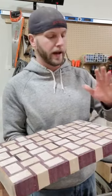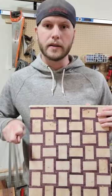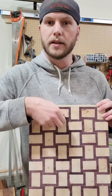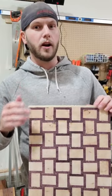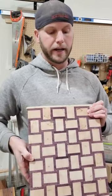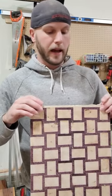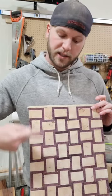There are two things that can go wrong. With an end grain board, the grain of the board is running out from the board, which means that it's very easy for the blades of the planer to catch some edge and just rip the board entirely. So that can go wrong as the board is going through the planer itself. It could just essentially get stuck in the middle on one of the blades and explode. That's a bad situation.